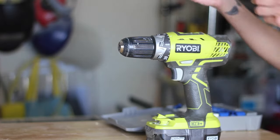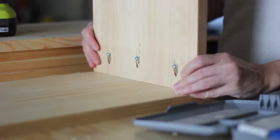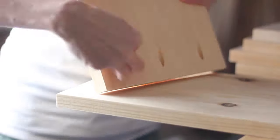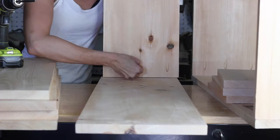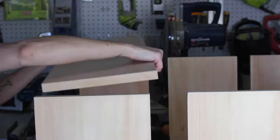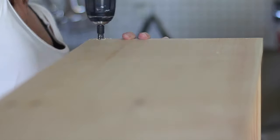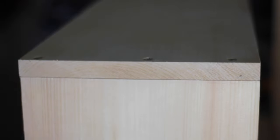I swapped out my drill bit with the driver bit that came with my pocket hole jig. I attached the ends to the long pieces of 1-by-12 using 1-and-a-quarter-inch pocket hole screws. We're working upside down right now, so this long piece will be the top of the shelf when we flip it over later. After the tops have been attached to the sides or ends of the shelves, I attached the bottom — remember we're working upside down — by pre-drilling holes with a countersinking drill bit and then attaching it using 2-inch wood screws. I used pocket hole screws on the top side so when we flip it over the screws won't be visible from the top.